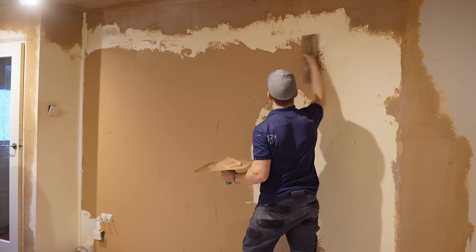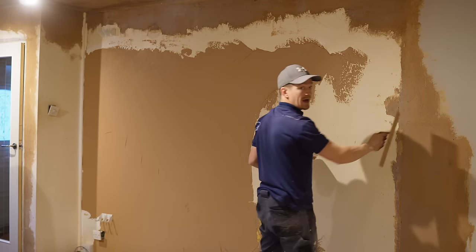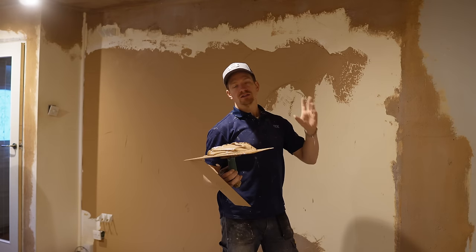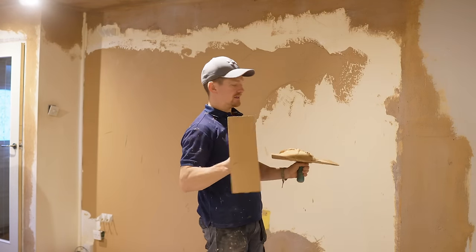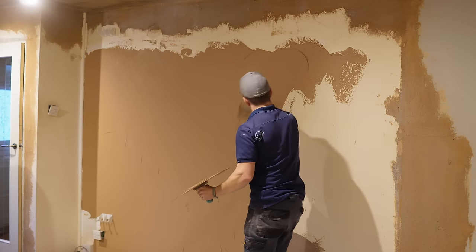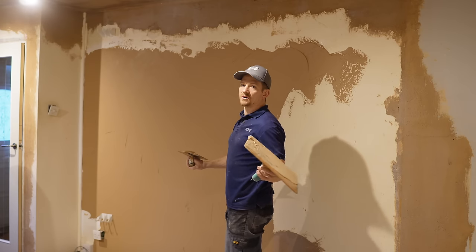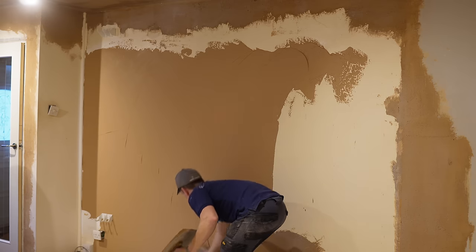Because we've got bonding and areas we've built out, we want a nice fat first coat of plaster to get over this. General rule of thumb when plastering onto bonding or hardwall: the thicker the plaster in terms of thickness, the better. Put it on quite thick — that first coat is going to take all the damage and allow the bonding to suck it out a little bit without worrying.